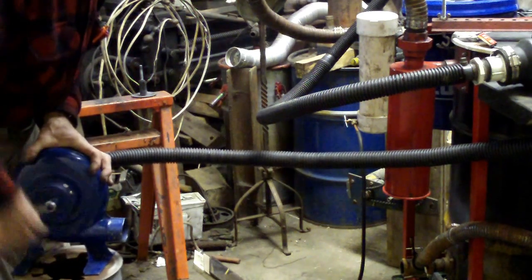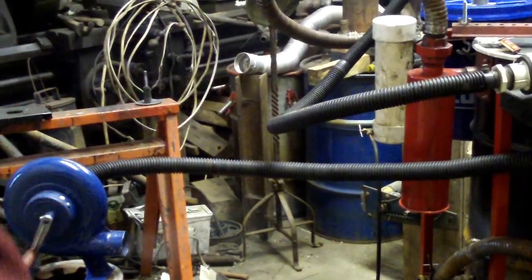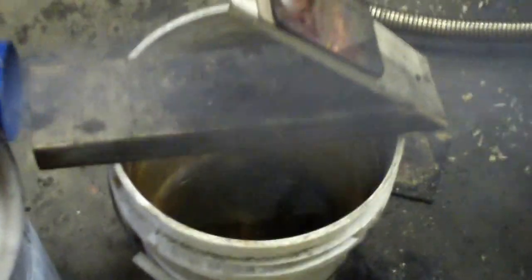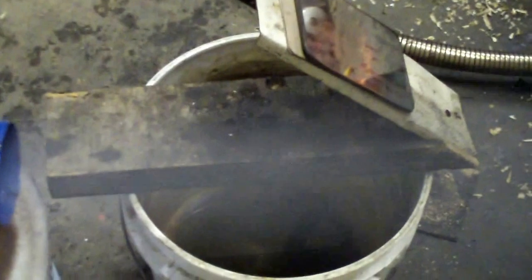That's why it takes a little while. The easy way is to use the 12-volt startup fan. You can see the color of the fire inside the nozzle, and you can also see some vapor coming out of the hand crank fan. What you see is water vapor — this typically happens every time you start up a charcoal gasifier, and since it's kind of cool today, that's another reason. Now, this has carbon monoxide in it and it's deadly. You don't want to breathe too much of this stuff. I'm in a rather large open room, but beware that this stuff has killed many people over the years.